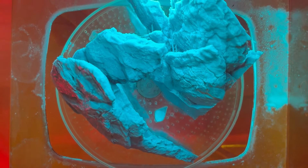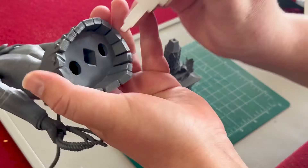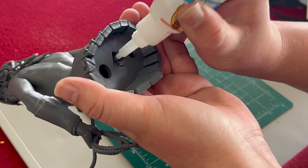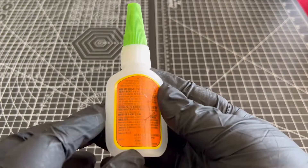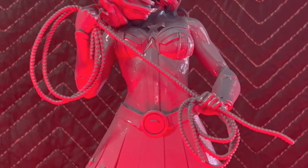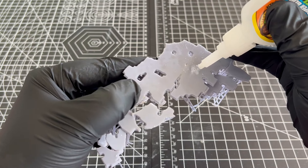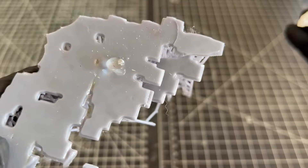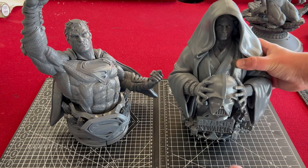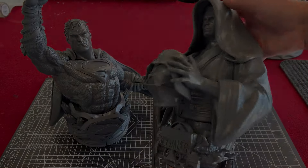When your prints are ready for assembly, you need something to hold them together. I use super glue — more specifically, super glue gel. I mainly use the Gorilla Glue one. The gel works great because it doesn't run like traditional super glue, so it's easier to work with, and because it's not completely flat when applied, it gives the pieces more surface to grab onto. I have a few large pieces weighing around 4 pounds and I've never had any issues with them coming apart after applying the super glue gel, so this stuff is pretty strong.